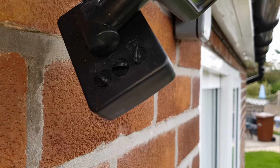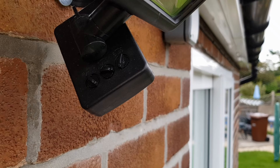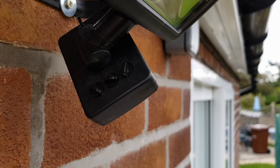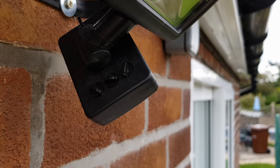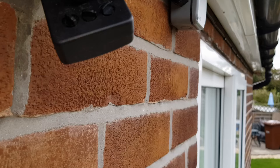In the instance of this PIR sensor, sensitivity is basically how far away from where the light is the sensor will pick people or other objects up to turn the light on. Generally, with these sorts of switches, the lowest setting — so for this particular one, if you turn that little knurled knob anti-clockwise — that's the lowest sensitivity.